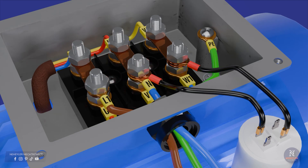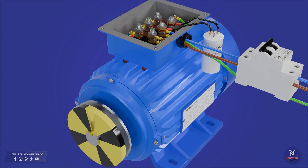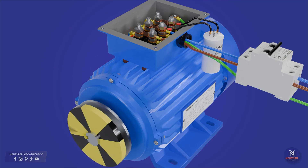That way the motor will rotate in the other direction. If you still have problems and your motor does not start and only makes a noise, then you will need a starting capacitor. The approximate value is equal to twice the value of the permanent capacitor, and this should be connected in parallel. This starting capacitor should only be connected for one or two seconds and then disconnected, since it only serves for starting. At the end I will leave the video where the starting capacitor and the run capacitor are used.